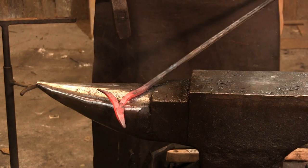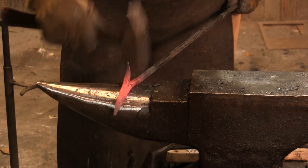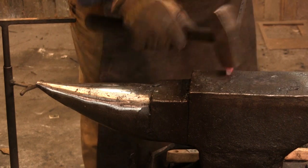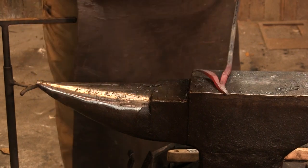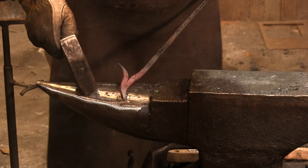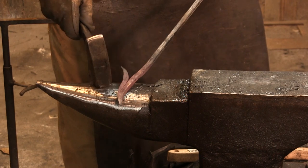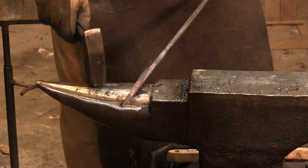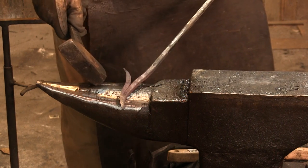You're going to have to play with this just a little bit because this is going to get all kind of wonky — but that's okay. If you saw that it popped up right there, that weld didn't quite take. So I'm going to hit it one more time with flux — seal that up and then do just a little bit more shaping and I think she's ready to go. Got ourselves a good heat.